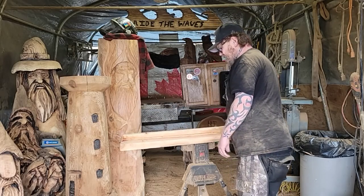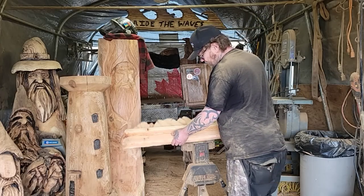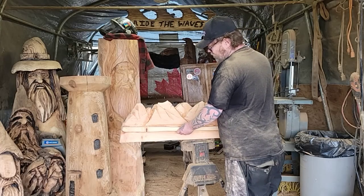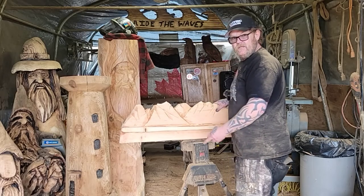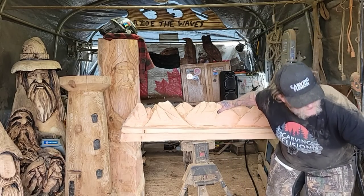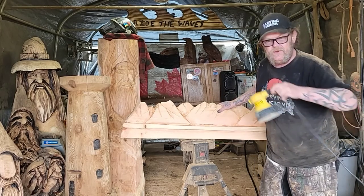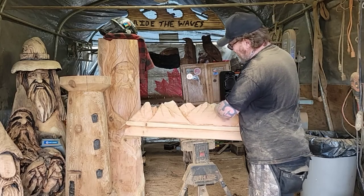I've carved lots of this wood. This is what my headboard's carved out of, and I've got some other carvings in my room made from it. It's just super wide grain, soft cedar. I didn't spend much time cleaning this up. I used the grinder with a 120 grit flap sander, and then went over it quickly with this orbit sander. But there's still tons of marks on it.